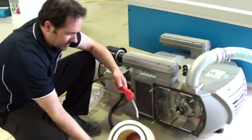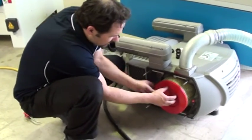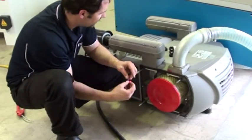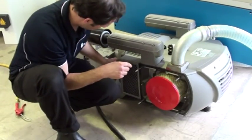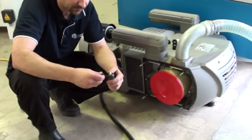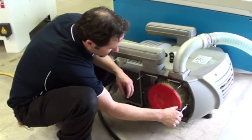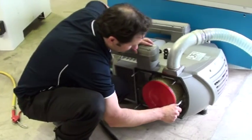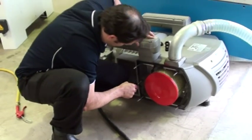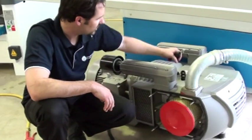Very simple — if you see the dust in there, just blow it out. As you can see, this one has very little dust in it. On this newer range of VTLF250 pumps, your greasing points are right here, next to the filter itself. The actual grease gun comes on the side of the pump itself. You can see it's a concave grease nipple, and it just goes on to the grease nipple itself — a quick couple of pushes — pumping fresh grease into both the front and the rear bearings on the pump.